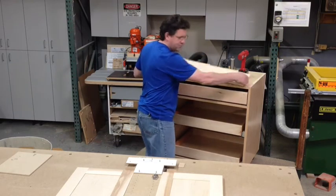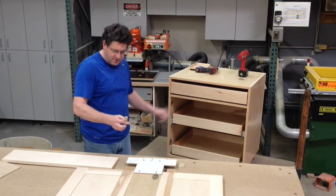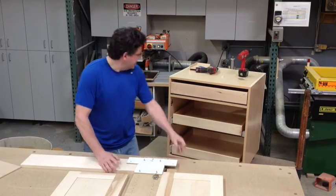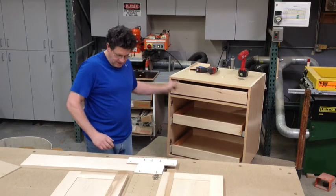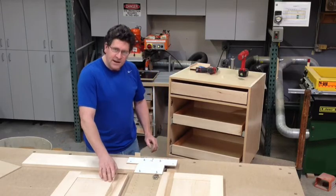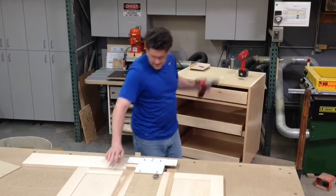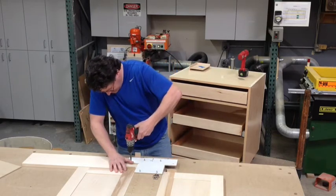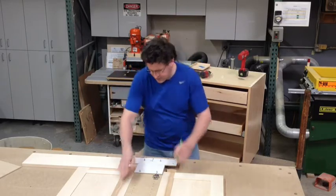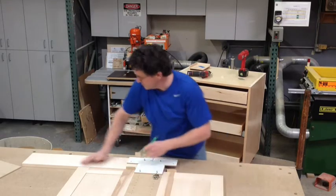Then, with our drawer front, we take it over to our jig, and in this scenario we need an 1/8 inch gap here, so I'm going to put an 1/8 inch filler in, right here, put our drawer front up to it, and we also need an 1/8 inch gap at the top, because this is a typical kitchen cabinet. So I put my 1/8 inch spacer at the top, and then I need an 1/8 inch between the drawer front and the door, another 1/8 inch spacer. Line that all up nice and tight, take my Vix bit, give me a pilot hole for the drawer front adjuster, and then I'm going to mark out my center line for the hinge plates, and then I'll do the same thing on the other side.